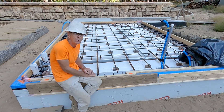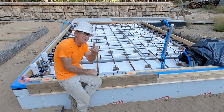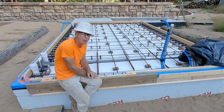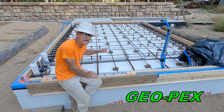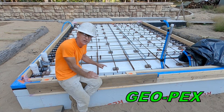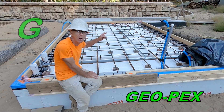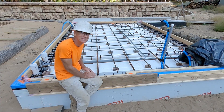So that's it. Up to this point we're ready to pour a concrete cap on it, but I'm going to stop and do one more thing. I'm going to put PEX in the floor of the greenhouse, which is the roof of the root cellar. That PEX is going to work with the PEX in the floor of the root cellar, bringing that 50-degree temperature up into the floor of the greenhouse to be used as a heater in the wintertime. So let's get started with that.